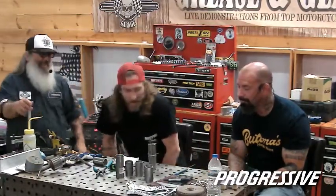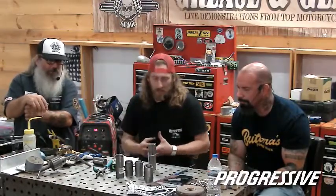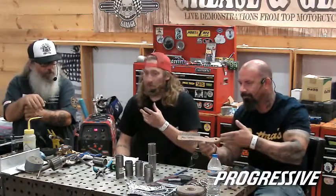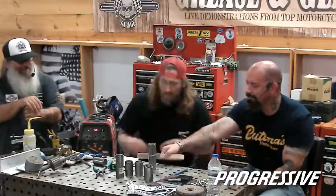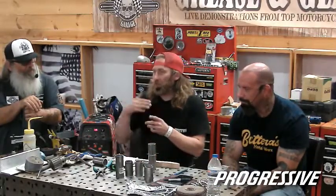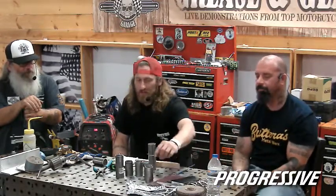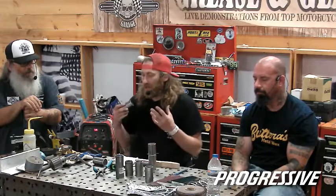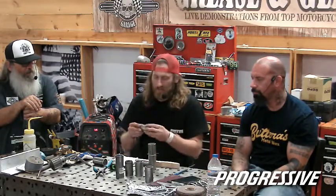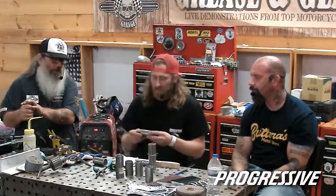There are different ways you could use wire brushes, stainless steel wire brushes, on a drill, for tubing like this but round. You can run it inside and out, right up to the edge of the weld, maybe an inch in, so you know you're not going to pull anything into the weld. Scotch-Brite is great for stainless for prepping an area. Then you want to acetone, because whatever you Scotch-Brited, oxidation, oils, glue, adhesive, acetone will pull any of that off.